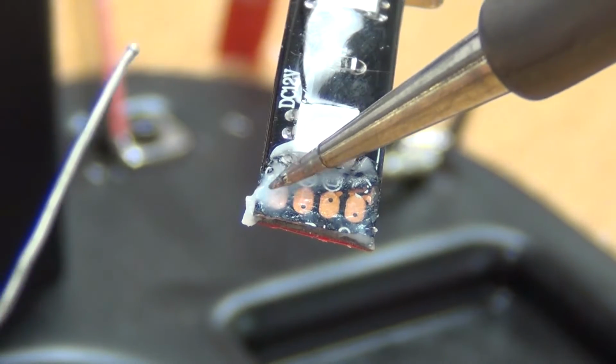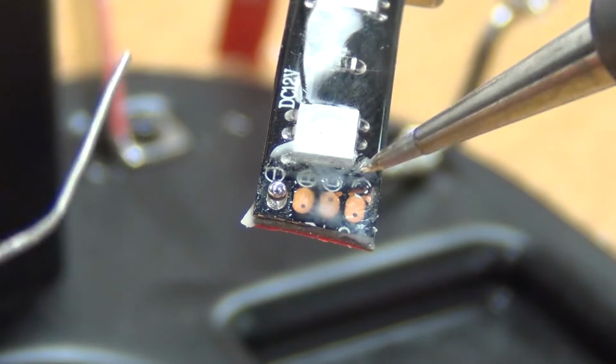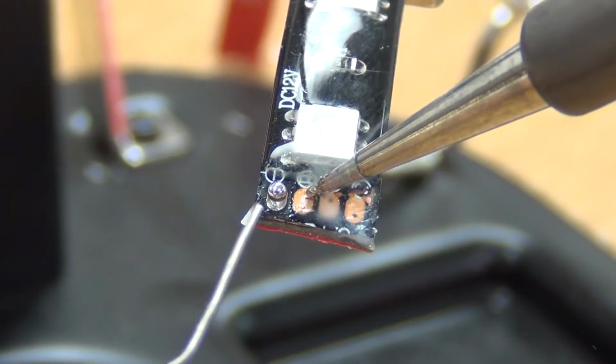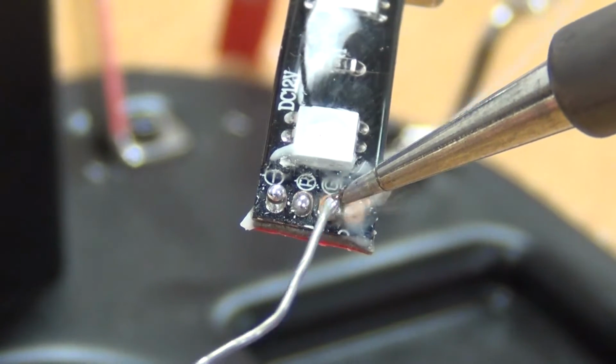Now, with the clean soldering iron, hold the tip directly against the copper oval just long enough for it to start turning white, then feed your solder slowly against it to form a small circle on top of each oval.